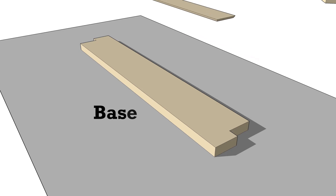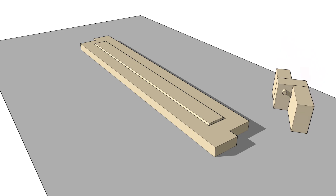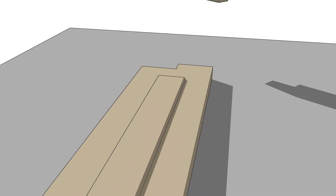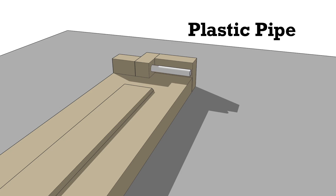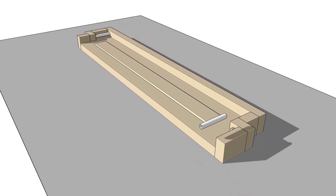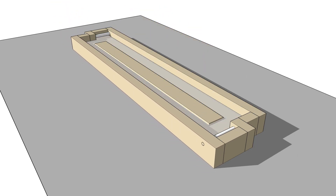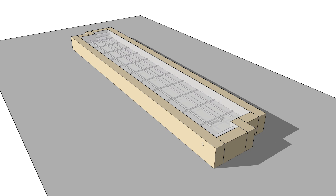The base is made from a 2x10 with a thin beveled inset. The ends and sides are also made from a 2x10. The ends and sides have a peg made from wooden dowel to hold a piece of plastic water pipe in place. There are three main parts to the form: the base, two identical ends, and two identical sides. When filled with CSA concrete, a galvanized wire mesh is laid in for additional strength. These thinner panel forms are constructed in a very similar manner as the ones I built in Part 2 of this series.